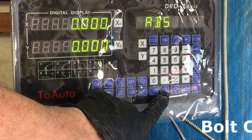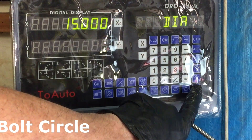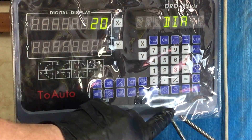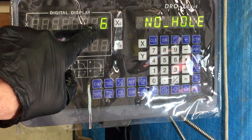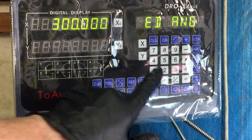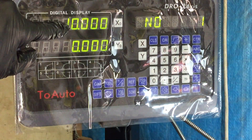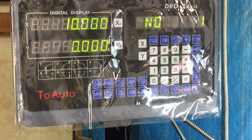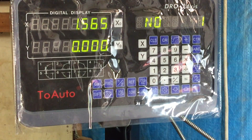Next thing I'm going to try is a bolt circle pattern. I press the bolt circle tool and the center is where I am. I'll set a 20mm diameter, pressing enter once I put the number in — six holes, starting angle zero, ending angle 300. Now it tells me to go to the first position, so I move the X axis by 10. As the carriage is a lot higher geared than the cross slide, it tends to be a little difficult getting it right on zero, but it is possible — just by going tappity tap right at the very end.